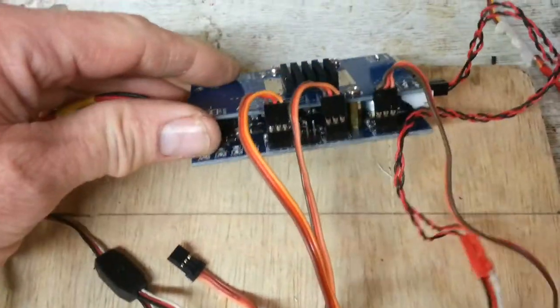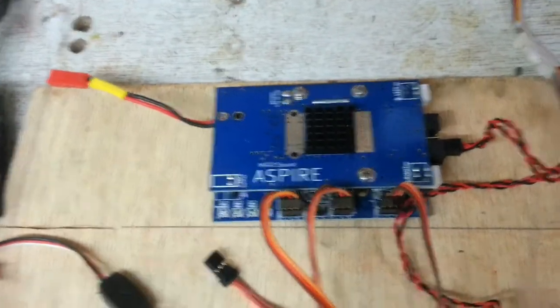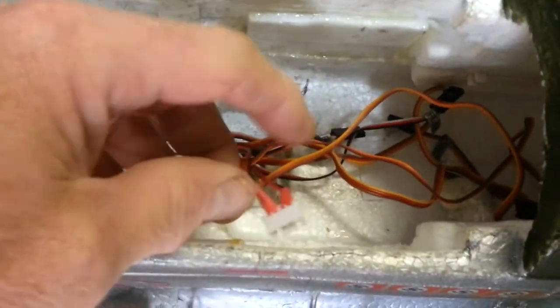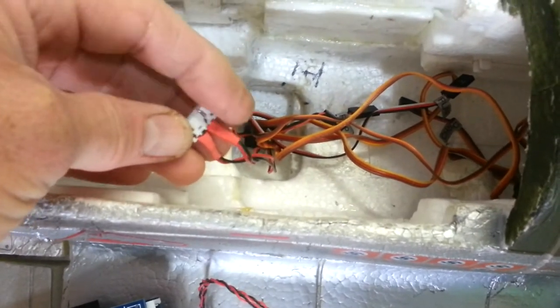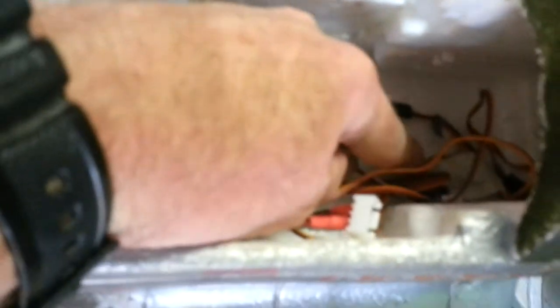Hopefully that'll help with some of the wiring around Aspire. It is all in the instructions - if you go on the website and go to the 'more info' tab on the top right, you'll find detailed instructions on both the V4.1 and the Aspire. In terms of where it goes in the model, I'll come over to my P51. You can see I'm ready to install it again - there's my gun LED hookup. These are pennies off eBay. All I do is run the wire under the wing out to the LEDs. The Aspire board sits right here in the FMS 1400 P51.